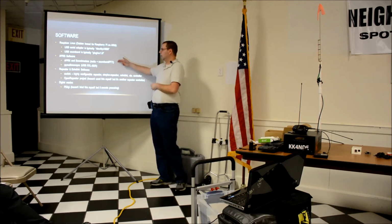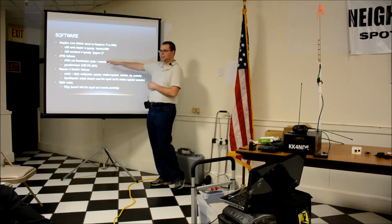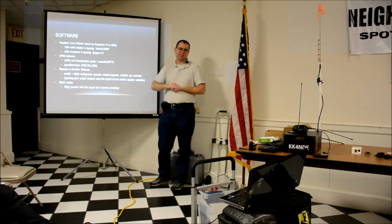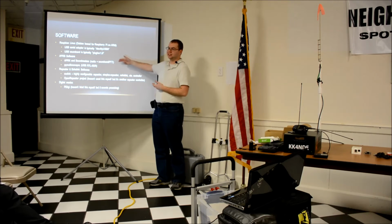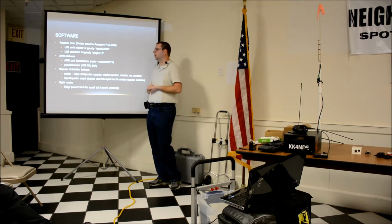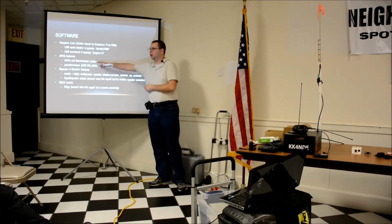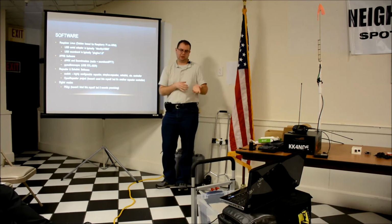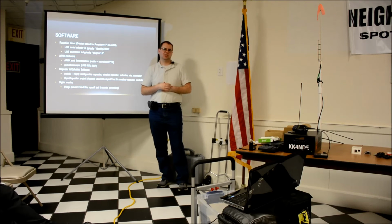For APRS software, I've used this Pymon APRS, if you can say that, good luck. It's for the USB SDR. It's fairly simple. You tell it here's what the frequency is, here's what my APRS key is, here's where I am, go listen, and it goes and listens. Then for the digipeater, I'm using APRX, that's not a typo, I don't know exactly why it's called that. APRX is the control software that does the digipeating, and Sound Modem is a software TNC. It converts the sound card into a network interface that the APRX software transmits and receives data over.